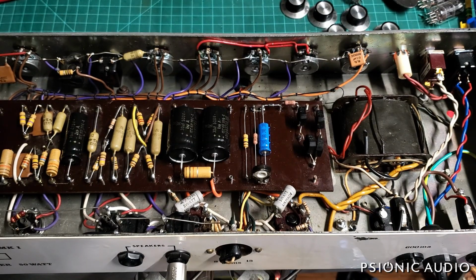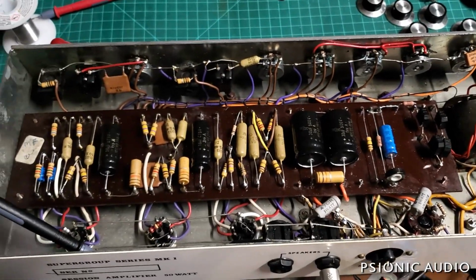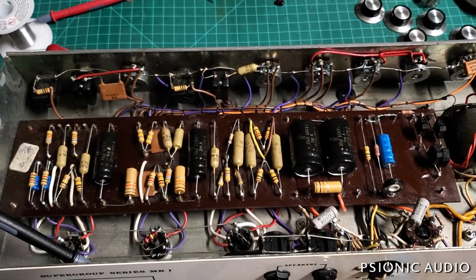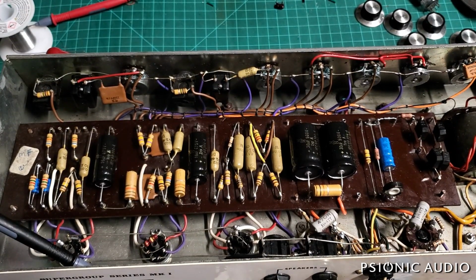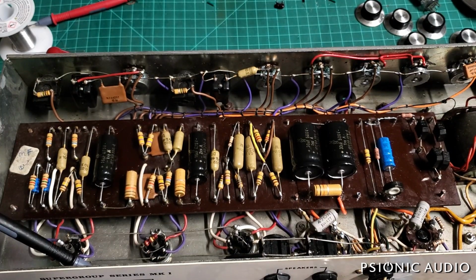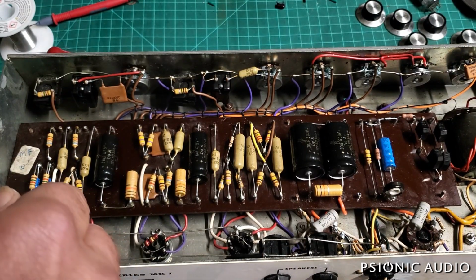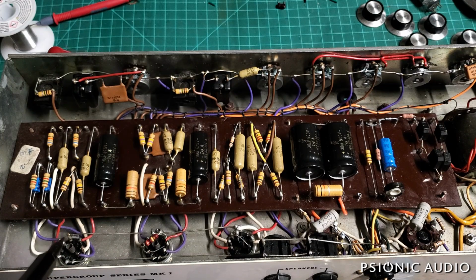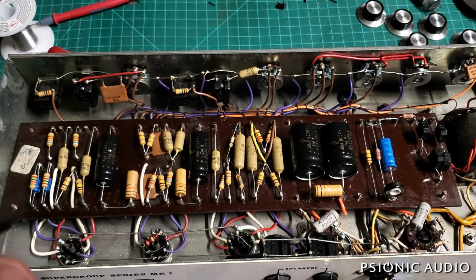It is essentially, let me move the camera down towards the preamp end a bit. It is essentially a Marshall 1987. Well, it's kind of in between, say, a lead and a bass, a 50-watt Marshall from the same period. You have a split cathode, and each triode, let me move the ground measurement out of the way. Each triode here, this is for input 1, this is for input 2, has its own cathode resistor, 1.5K and 22 microfarads, so full range.